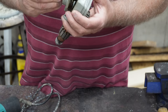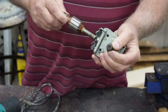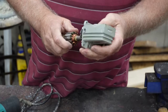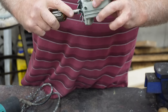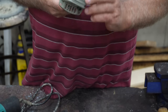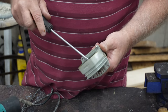I'm not sure why the thing didn't turn the way it was supposed to, because nothing really looks that off. But if you hold this and turn this, that shaft does not turn — there's definitely something not right. I see now — this gear here is sheared off or something. Let's get it out of there and see what we got. I bet that's supposed to be on splines or something. That's why it doesn't go — that just spins on there.